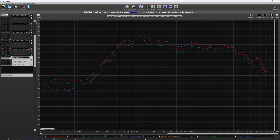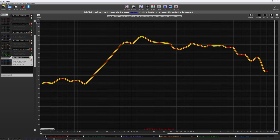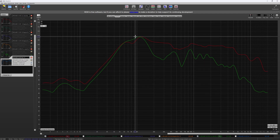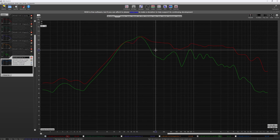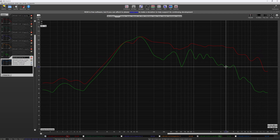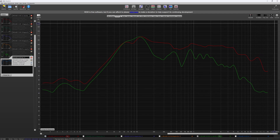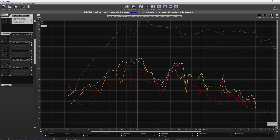I did test at various angles off-axis as well. The response was very similar among the different axes. All tests were performed at 71 millimeters from the center of the speaker — you can see them on the screen now. I also tested the passive radiator side facing the mic and was intrigued by the result: it essentially mirrors the active side up to around 100 Hz without that dip, then falls off at an increasing rate with various spikes, which I assume are at resonant points and factors of resonant points. I will put the distortion graphs up for any interested viewers — feel free to pause and inspect them.